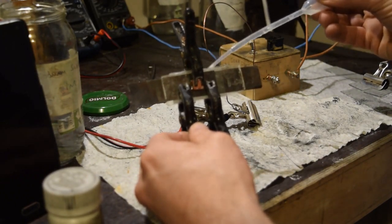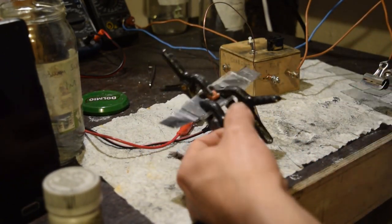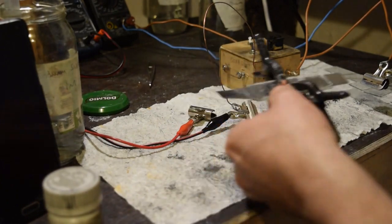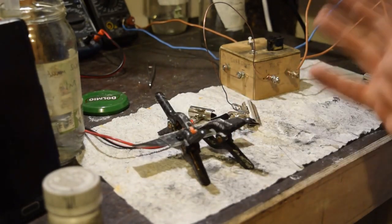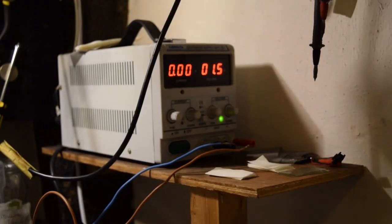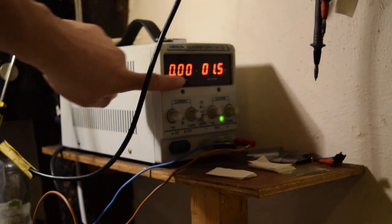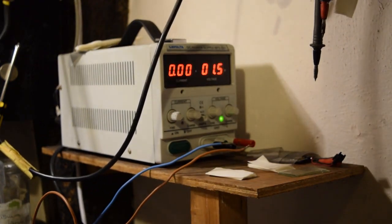Just that last little bit of charge, that last bit of capacity - give it five or ten minutes to charge up basically, and allow that electrolyte to soak in the same amount of time, and then we'll charge it up. This is my power supply here used to charge it up. It says 1.5 volts but it's actually 1.6 if you check it on the voltmeter. Just by watching the current draw and how it charges up can give you a good idea as to how your carbon is going to perform, and can help you make comparisons.